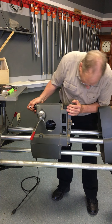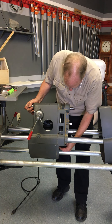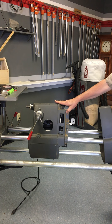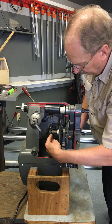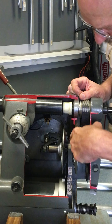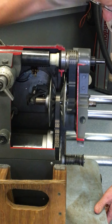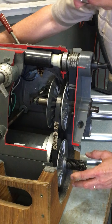Now this is pretty much a dirty mess. We're going to get into the motor sheave down here and disconnect the control sheave up here. That's going to be difficult to see, so to make it easier for you to visualize, we have this cutaway headstock. The belt is all the way down in the control sheave on the idler shaft, and the motor belt is out to the circumference of the motor sheaves — that's the easiest way to work on it.